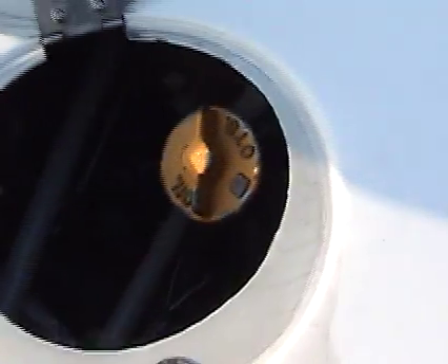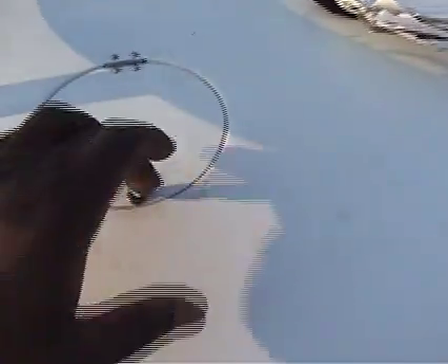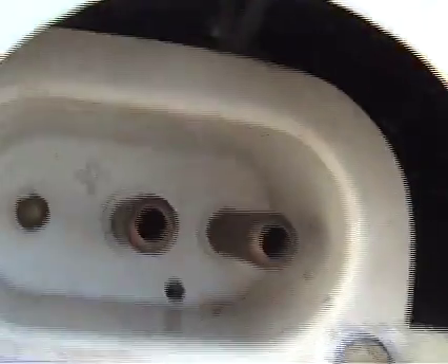We're almost finished with our pre-flight. Make sure I close that back and secure it, check all the screws. I like to check all the screws for security — that's not just something I do for my peace of mind. Check your air vent, your ducts — make sure no bird nests are in here, this is how we get ventilation. This is where, if the battery goes dead and you need to jump, you plug it in and do it like that — it's a safe way to do it. Just check the compartment, make sure there's nothing irregular in here, and make sure you secure that back.